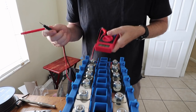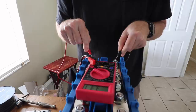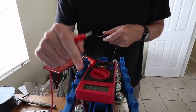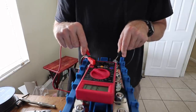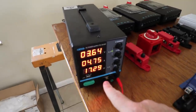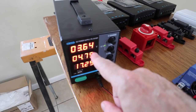I have my voltmeter here — this is charging right now and I'm going to measure the voltage while it's running. I put the probes on and I'm getting 3.31. So I started at 3.28 and now after 24 hours it's at 3.31 — it's hardly moved, maybe three hundredths of a volt. Here's the charger here, plugging away giving me 17 watts, trying to get it up to 3.65.